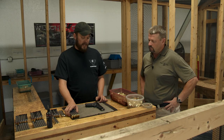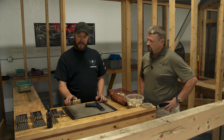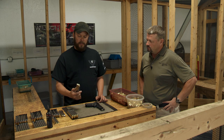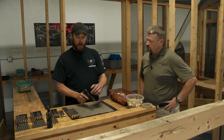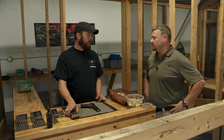This is the function test part of the test fire, and we start here with five ten-round magazines. We fire the first two rounds off the top of the magazine, then eject the magazine and fire the last round to ensure that the weapon is ejecting the rounds properly and not off the top of a bullet that might still be in the magazine. Otherwise known as the extractor tension test, which is critical on a 1911.